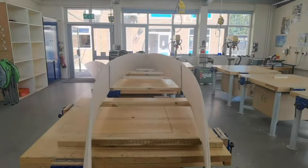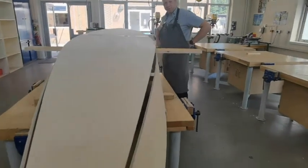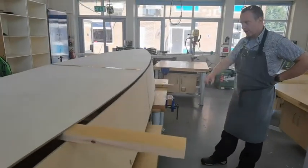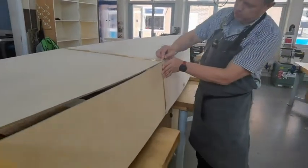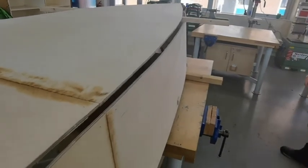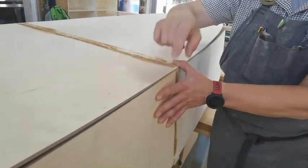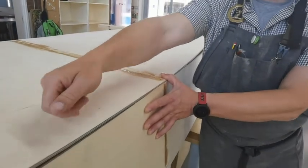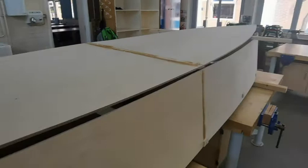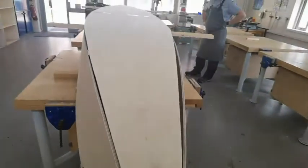So we've just flipped it onto its belly and got a couple of supports on. The base goes on — look at that. We've flipped it up, inverted it, and put these supports on here. We put the base on and checked it all lines up — we did a rough line-up and it's all where it should be. So we're going to start by aligning these seams up here, tape around here, and then work fanning out either side until it's taped into position. It sits on the edge — this bit goes inside and that sits on the top there. Then I'll do a little round-off on there with a router. The tape stays on until I've bonded the inside, then pull the tape off, round it, and then there's a piece of glass fibre tape which is epoxied onto there. You'll see all that in future clips.